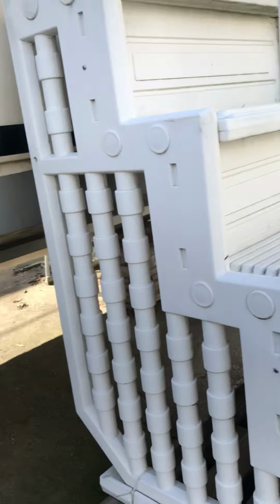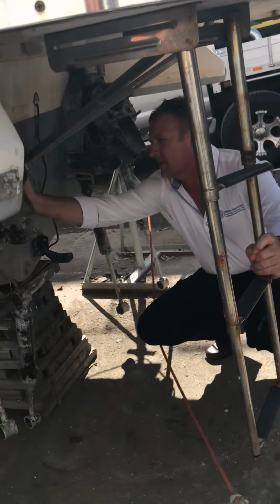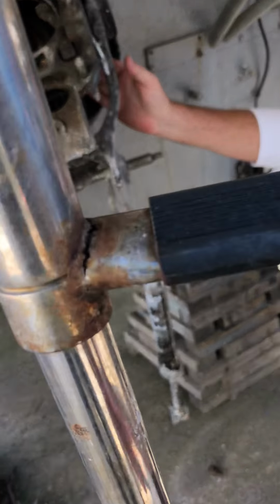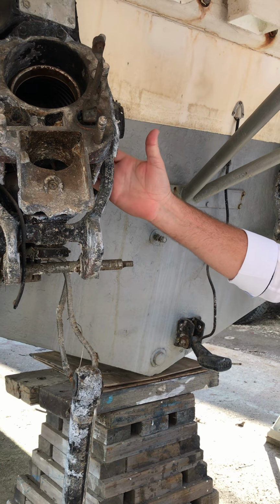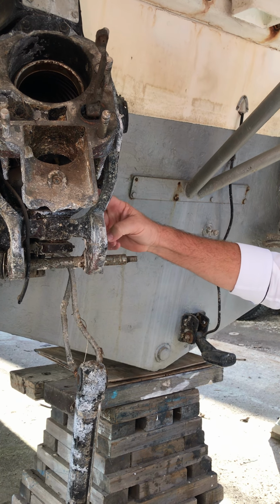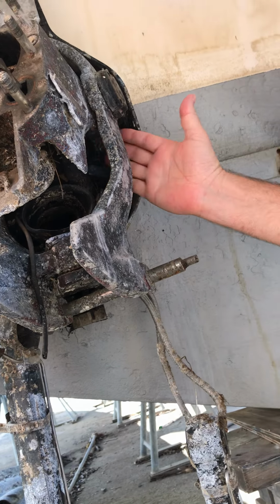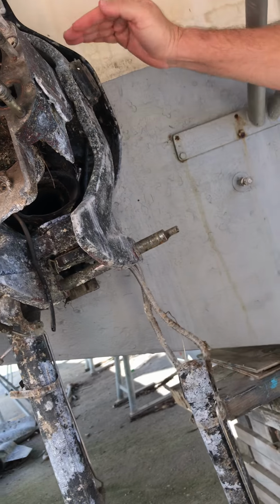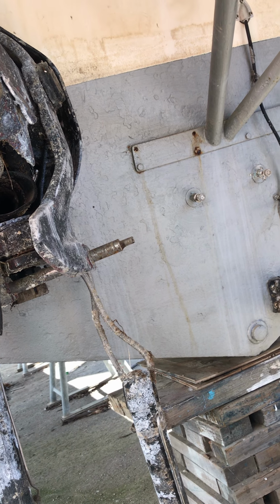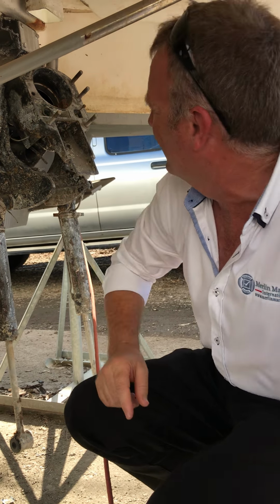Propeller. The boots at the end, we're talking about the joints. You've got a propeller shaft, like a variable shaft that comes out of here, and that's the only thing stopping the water. That's an exhaust port, and these things are all your control rods and levers. Once barnacles grow up in here, it crushes and then tears the boot. This is all below water, so it backfills your boat, and your boat starts sinking quite quickly. More like this one as well, but you've got two.